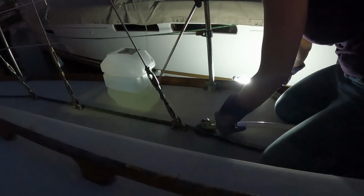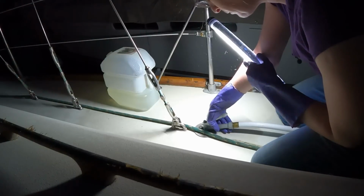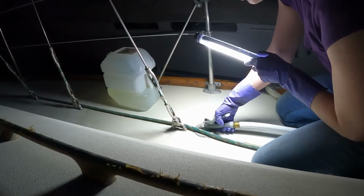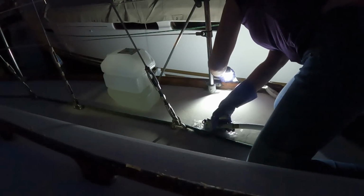I'm hoping it's actually going to come out the vent. That means I've got the bleach solution into the vent lines. Oh, I think we're almost full. There it goes. Water's coming out the vent. I'll show you what I mean. I don't know if you can see that because I can't see you, but that's the vent right there, and I wanted to see water gushing out. So if anything had been starting to grow in there, it shouldn't be anymore.